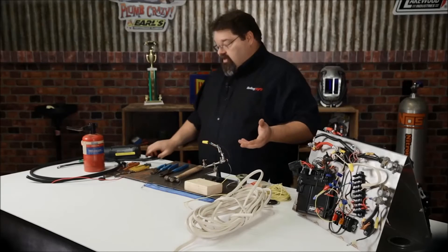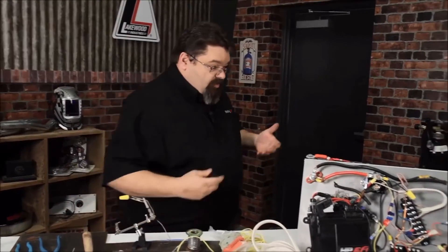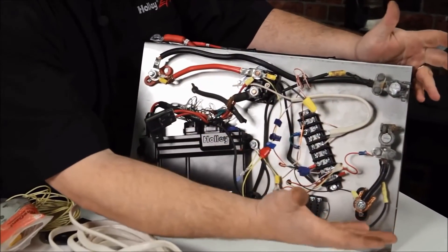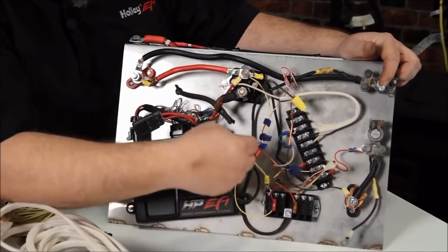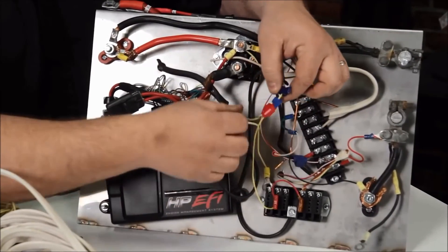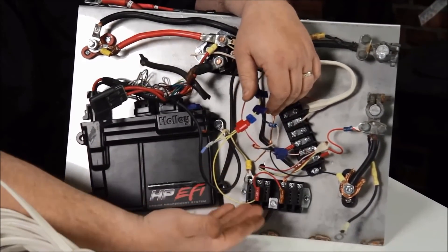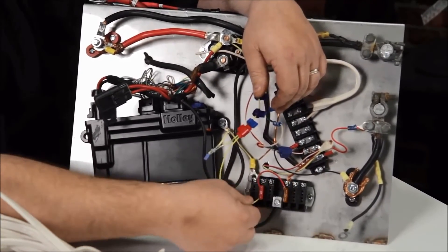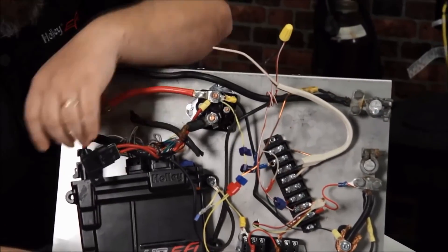This is just for a little bit of fun showing some things you don't want to do — but we see this stuff happen all the time. There's nothing better than big old corroded battery terminals. I love when you see a screw or a nail drove in the top. You'll see the wrong gauge wire, t-taps — don't use them, throw them in the trash, that's the only place they're good for. I love when somebody's cut the fuse block, bypassed wires, jumped underneath a fuse, and used fuse taps. Romex and wire nuts — they keep things going.